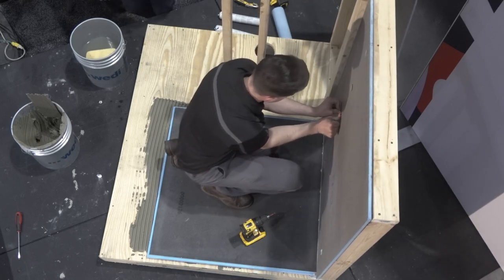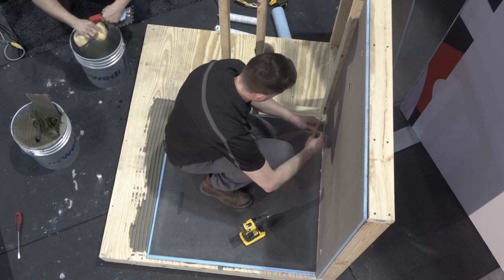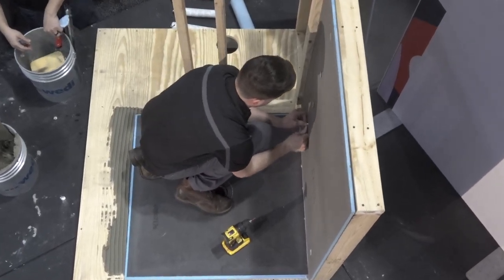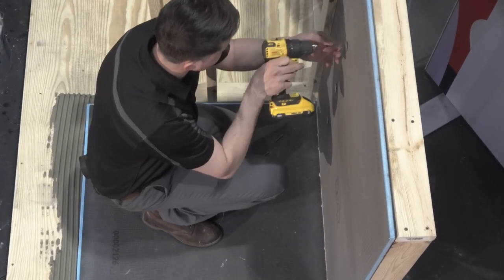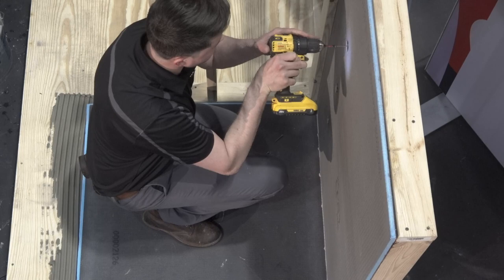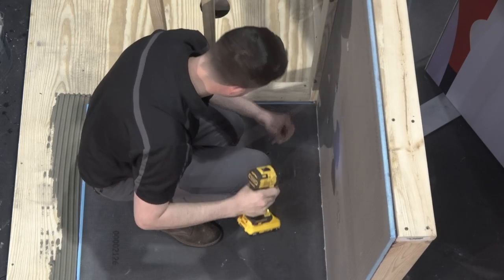This process takes place throughout the entire shower regardless of size or shape. Once you get the first application of sealant going, you come back with a second half-inch bead of sealant and tool that out with the corner putty knife — we'll cover that more when Greg gets to that point.